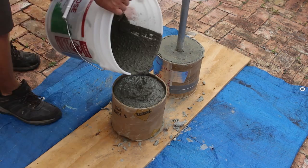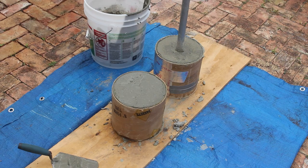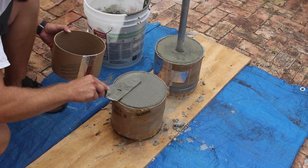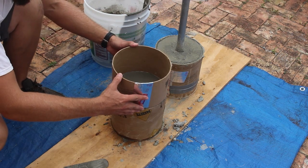You're going to repeat the same steps on this side and use that spacer to help hold the top half of the dumbbell in place. I cut the spacer lengthwise beforehand and then taped it back together — this just makes it easier to get off after the concrete dries. You're not trying to cut through that thick cardboard again; you just have to cut the tape.